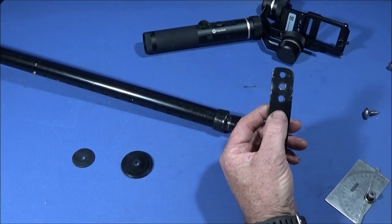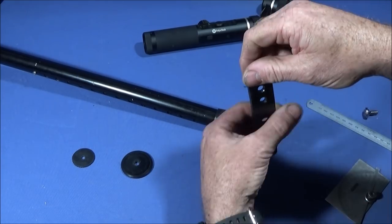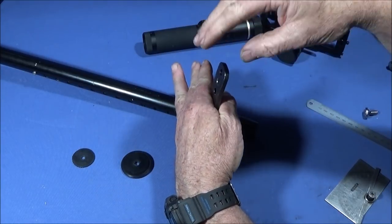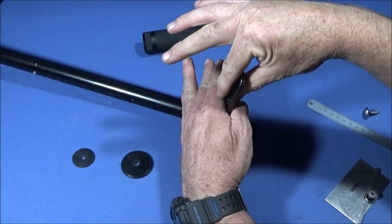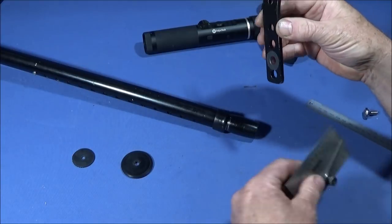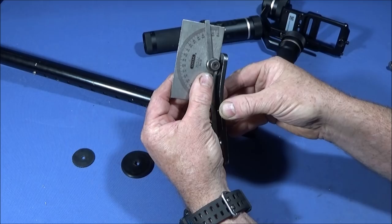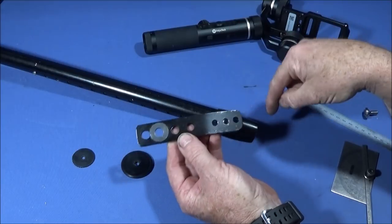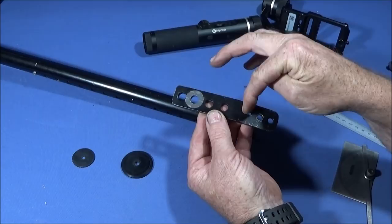And the last 40mm I had in a vise like that, and then I used a pair of adjustable spanner jaws down over there, and pulled it over to put the bend in it. And I made the bend at about 15 degrees. Before I did that though, I drilled it obviously for the 8mm Allen bolt, and I drilled extra holes to lighten it.